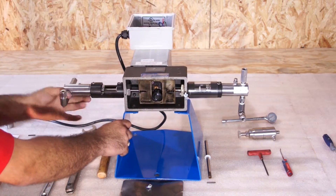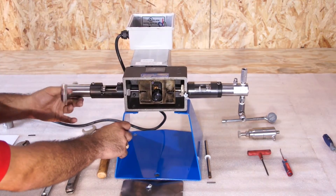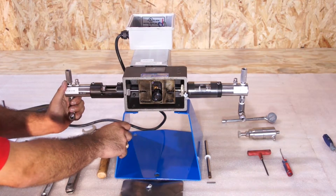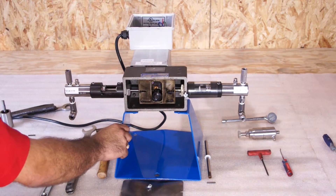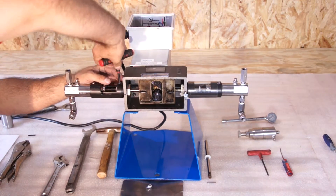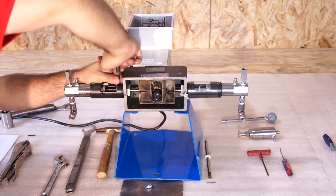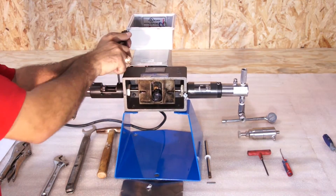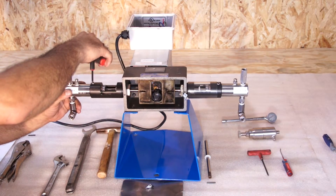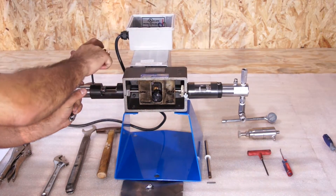Once you've bottomed the pump head onto the yoke, back it off and turn until your suction and discharge checks are vertical — straight up and down. Then proceed to tighten the yoke at the pump housing, then move back and tighten your head to the yoke. Once you've completed that process, you've double-headed a pump.